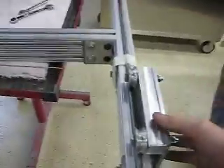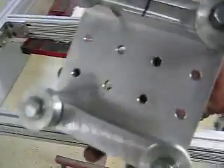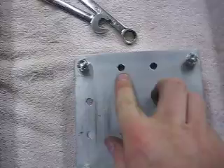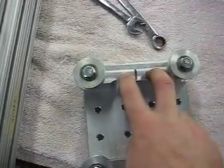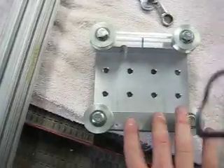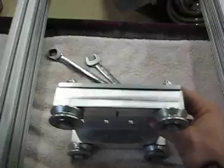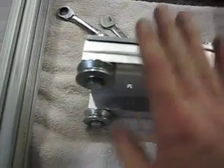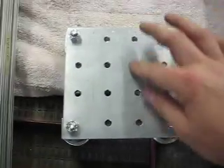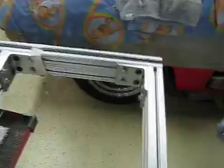The gantry — pull this off and you can see it's very simplistic. I'll center punch these points here and here and drill holes, so there will be bolts going through this. The whole vertical arm of the gantry will be bolted up in six different locations, and that should make the plate aluminum pretty rigid with all six holes having bolts going through them into the vertical arms of the gantry.